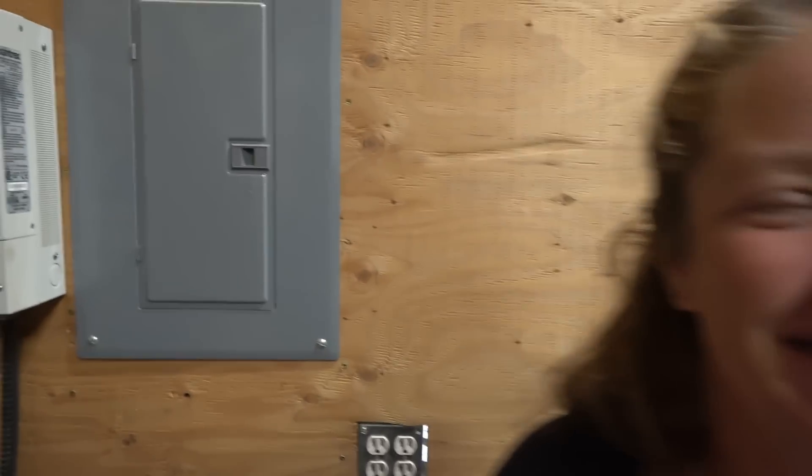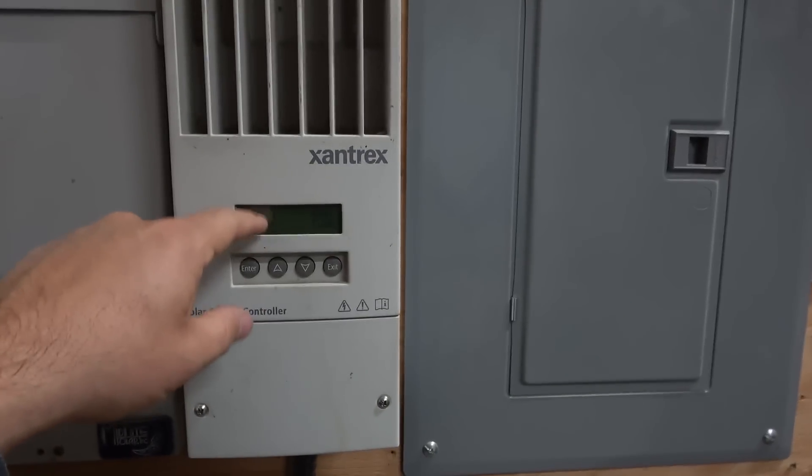So 60 amps at roughly 50 volts is three kilowatts — that's all I can do, and I have three kilowatts of solar right now, so I'm maxed. But that's a lie — you can always do better. We're going to overdrive this thing, and it's okay — all the professionals do this. Ten years ago maybe not, but panels are cheap now, so you should overdrive your system, especially if you want to build it up without replacing everything.